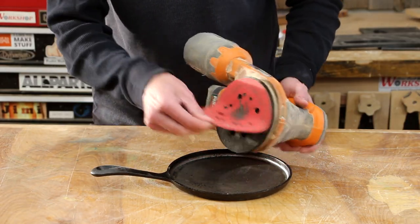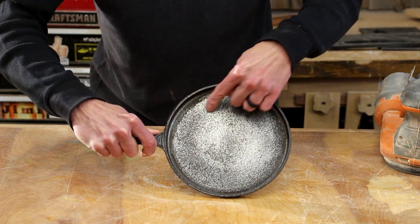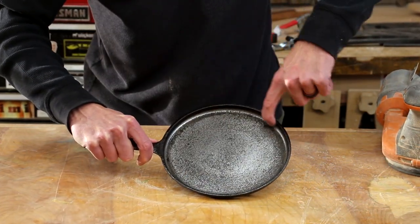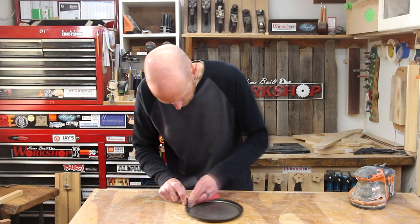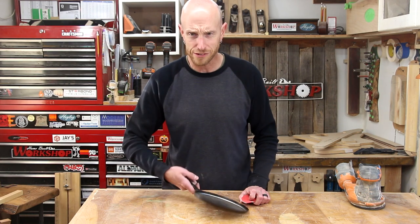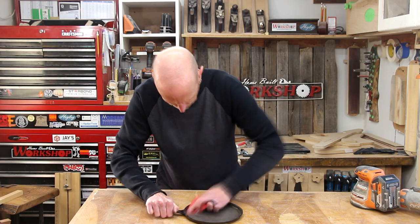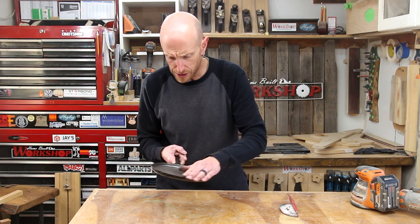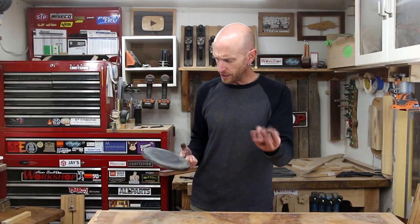Yeah, clogging up pretty quick. But if we take a look at this, you can see all the dots and things where it's sanded off the high spots, so it's feeling pretty smooth on the bottom. It's still rough around the edges, so I think I'm going to go ahead and start sanding that by hand. Hand sanding on cast iron — boy, that's messy. It's feeling a lot better though. Those bumps and uneven edges are feeling a lot smoother now. I think this just might work — that is a dusty job.